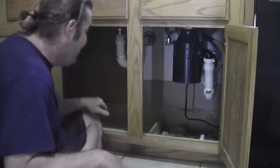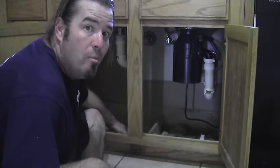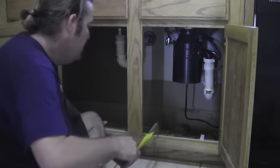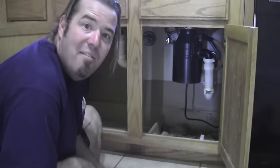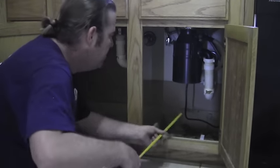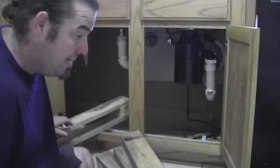Next, we want to build a frame for the floor to sit on. We can't just stick a piece of plywood in there, otherwise it's going to be floppy and look like a homeowner's special. Now my floor used to sit at this height right here, so we're going to measure that height because that's where we want our board to sit. I got 5⅛ inches. Now I get the width and length — 45 by 19½.